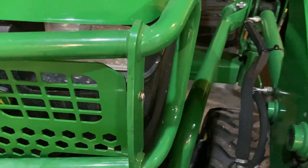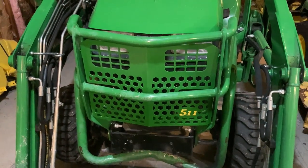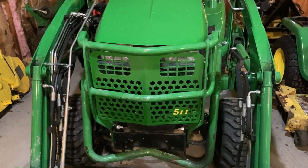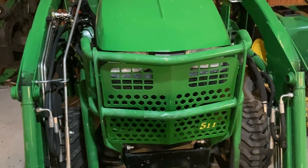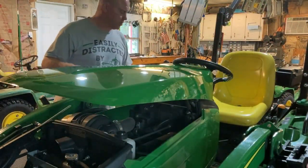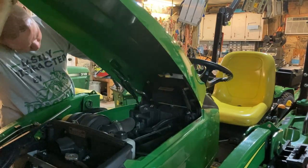Well, there's the final product. Just two bolts on this side, two bolts on this side. The biggest issue is just drilling through that thick plate you see right there — once you get that done, it's all pretty easy. I would just recommend getting something on there, whether you fabricate something yourself or buy one of these or a competitor's version — get something on the front there to protect your hood, headlights, grill, radiator, whatever else might get damaged by kind of what I did. So now that I have the old hood off and I have the new hood, I can put the new hood on. Hopefully this will go easily, but this might be something where I need to get the kids for.